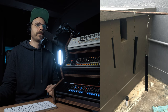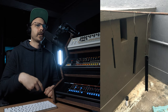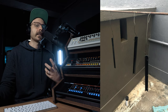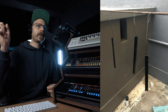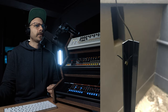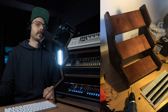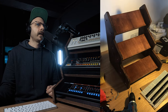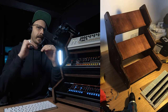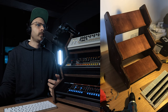While the rack stain and wood finish were drying, I went back up to the roof with my pieces of aluminium angle and sprayed them six or seven times. I started with a steel primer — a red oxide primer — just to be cautious about going straight onto aluminium. A couple of coats of the red oxide primer first, then three or four coats of black paint. It was supposedly a matte finish but it turned out quite glossy — I actually don't mind it, I think it looks really sick. Back at my office desk I started putting things back together, pulling the screws out temporarily so I could get the stain underneath the screw heads too.